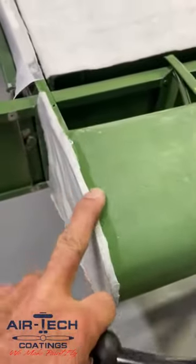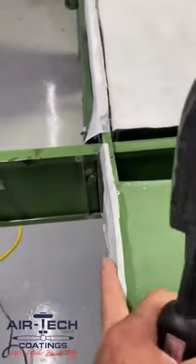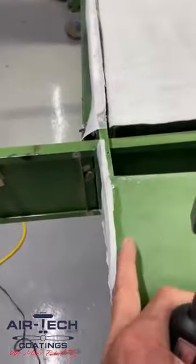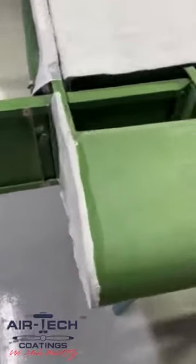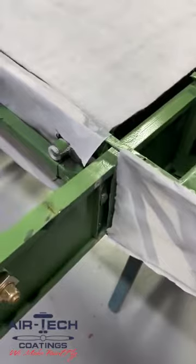Now you'll need another coat of glue on top of that when your leading edge comes around. You actually can bring that leading edge right out to the edge and razor, because all of this is going to be under the fairing. So that's just the way we do the roots. Everybody does them a little different. That just works out for us.